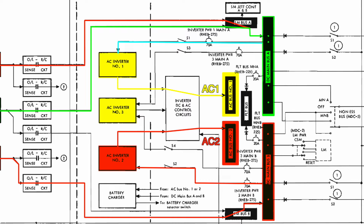Inverter 3 is indeed the only inverter that can be configured to be powered by main A and connected to the AC2 bus. But this will not get done because Gene pushes back. He is still in power reduction mode and worried about creating additional problems. Temporarily. Before you do that, would you like to make sure you got all AC loads you don't need isolated from the bus?